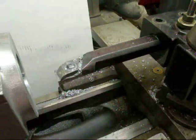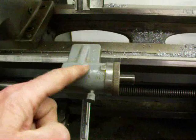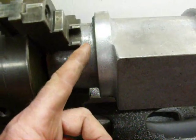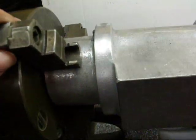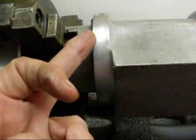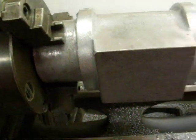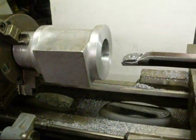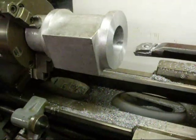I have set the carriage stop right here so that I'm actually boring a little bit farther than the end, approximately to where you see the chuck jaw. That's going to be sawed off later on, so here we go — just take a little bit of a cut, and that'll be enough of that.